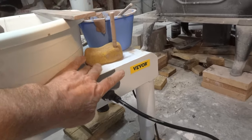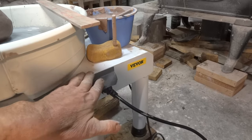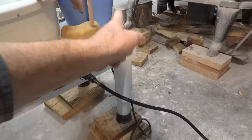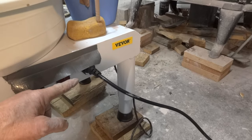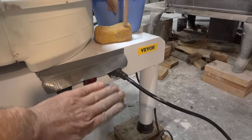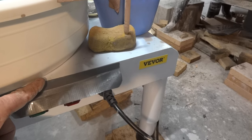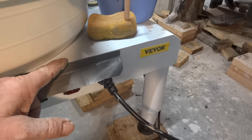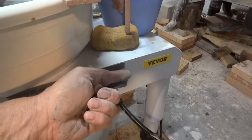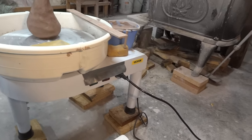Some splash is obviously going to happen and run along this edge — there's no lip here to stop water flowing down over the electronics. As a temporary measure I've put a piece of duct tape so the water drops flow off the side. What you could also do is apply a bead of silicone all the way along the edge here to provide a barrier to water flowing over that corner.